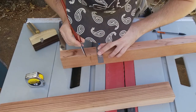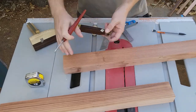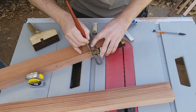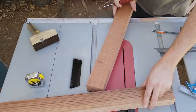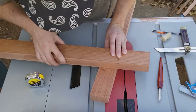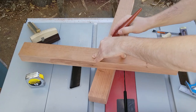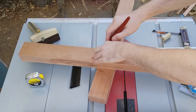I wrapped the line around the other edge using my square, and I matched up the lines on the last side using the bevel gauge. I took one of the shorter pieces that will go in the center and lined it up with the line I just scored. And I traced it with the knife to mark the bottom shoulder, undercutting it a small amount so it's a tight fit.